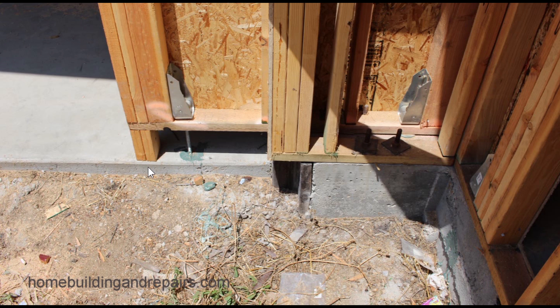I don't think something like this would be acceptable to a structural engineer. I don't think it would actually transfer the load — if there was enough weight, I think it would just break the concrete apart. Feel free to leave your opinions in the comments. There's a good chance this is just a six-inch garage slab, and it might have a bond beam underneath it — if it does, great. But if it's just a slab and this area needs to transfer load down to a larger footing, then you wouldn't have enough concrete or support to handle it.